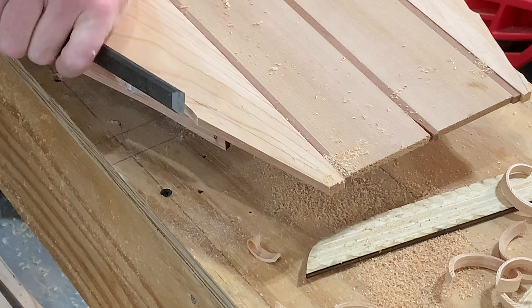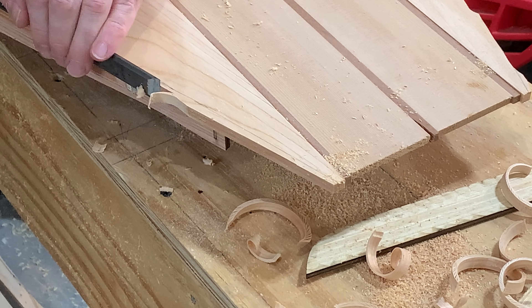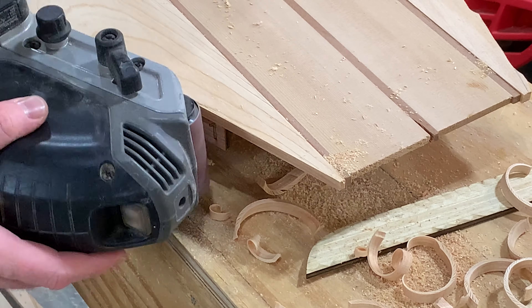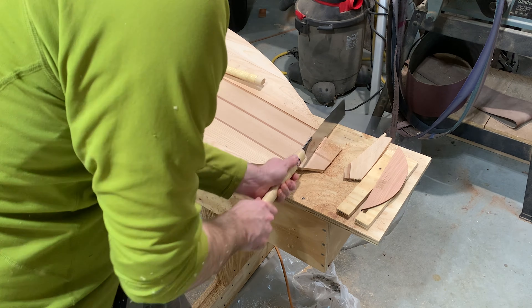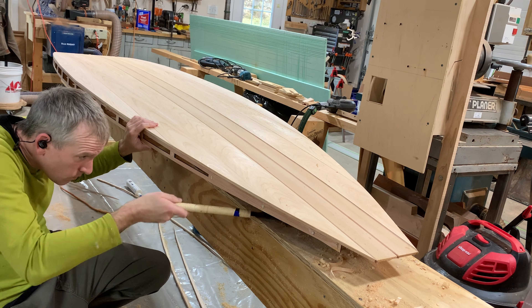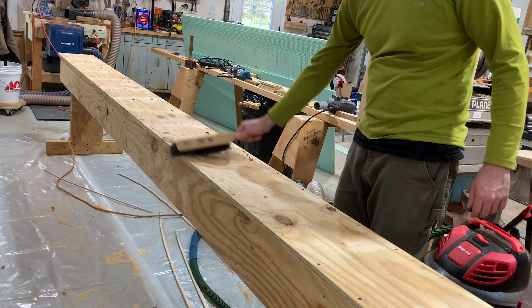Here you want to just make sure that your top sheet is really carefully in-plane with those side rails — that 90-degree angle wants to carry up. So you want to make sure that you have a nice glue line there against the rails to the deck. Cut the front off a little bit so it's easier to deal with, and then you can remove it from the mold right off the bench.